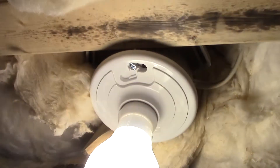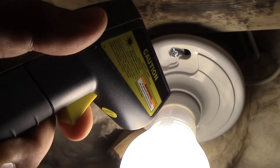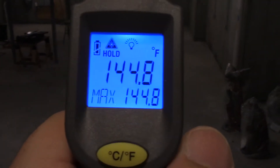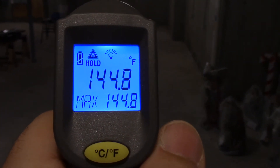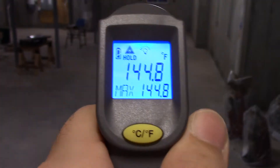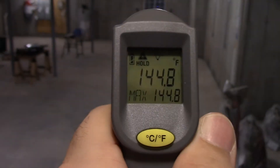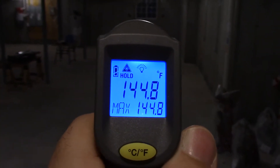Now the very top portion that looks kind of dark — let's have a look at that. That says 144 degrees. Now the part that I touched was totally fine, but the thermometer is probably looking past the plastic since it's kind of transparent. So you can see that some internal parts of this light bulb do get pretty hot — 144 degrees. To be fair, that's probably not as hot as an incandescent light bulb, but it's still 144 degrees and you probably don't want to touch that. The Cree bulb shows safe-to-touch temperatures on the outside, but towards the very top it does get pretty hot.